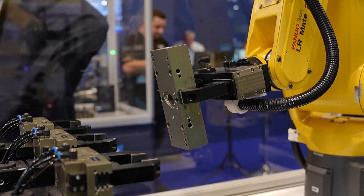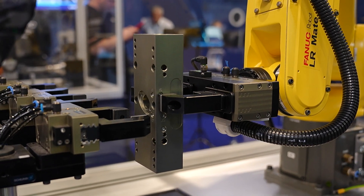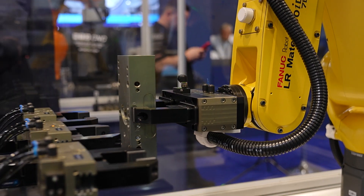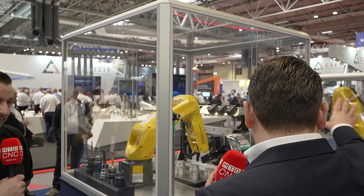This is something I've actually never seen before until we spoke a little earlier. So talk us through what is happening here. There's quite a bit happening. On the end of the arm we have a gripper with a tool changer, which can change the jaws for the end of the arm of the robot automatically. But the star of this show is this — here we have an auto jaw changing system. So if you ever try to automate machine tending on a lathe, vertical machining centres are fairly easy to automate: you can palletise, it's a flat bed, it's a more flexible and easy thing to approach.